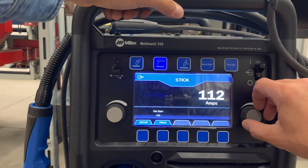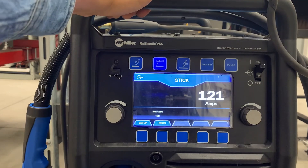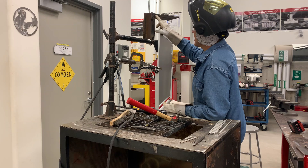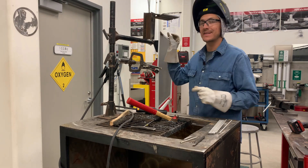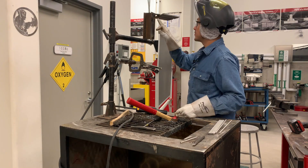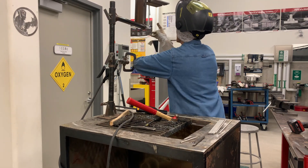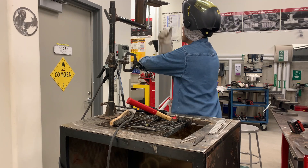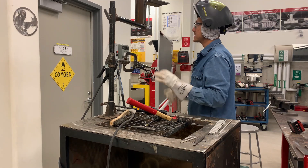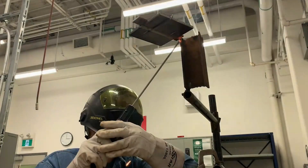We'll be at about 115 to 125 amps, welding with that 7018 electrode at one-eighth, right out of the oven. I've got my plate up where it needs to be. I gave myself an extra little tack in here because this plate needs to stay fixed. The inspector will come and visit to examine your stops. I've also got something set up to rest my arms on — you really want to get comfortable. If you've got a heavy stinger, you really want to be able to brace yourself.